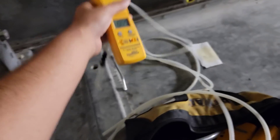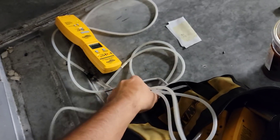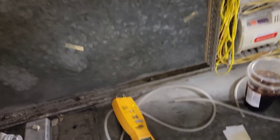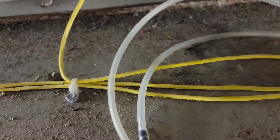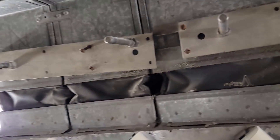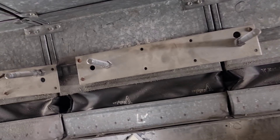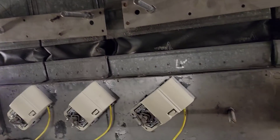Specifically, zone 8 is our main culprit. They're not getting enough air and it's getting hot. They've got a 73-degree setpoint and during the heat of the afternoon they're getting up into the upper 70s. I'm just wondering if any of these zones are even labeled — they're labeled south, southwest. Yeah, that's not going to help me much.